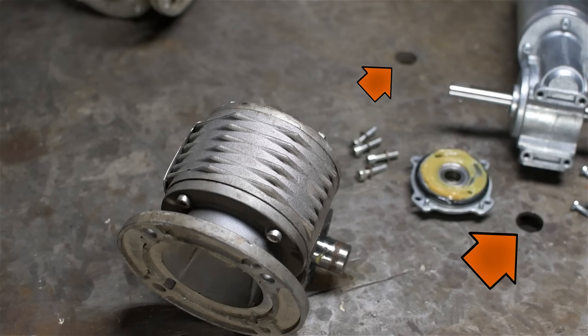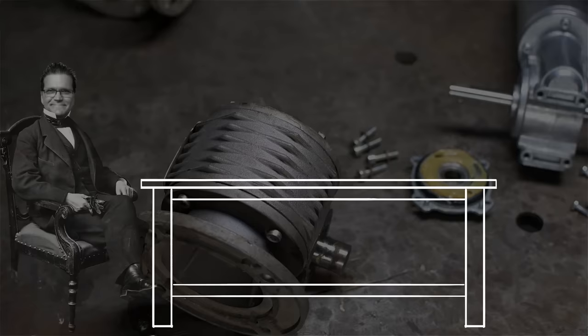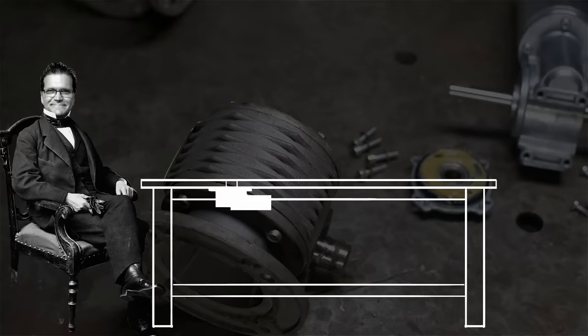Something I could just drop a 3 or 4 jaw chuck or faceplate into and have it at the ready whenever I needed it without it taking up additional space in my shop like a freestanding turntable would. Basically, the thought was to bolt the motor and gearbox combination underneath the bench along with the controller and electronics, nice and tucked out of the way. That, like I said, would give me a top accessible socket to plug in the turntable or the chuck, but that obviously would only make it a horizontal turntable.